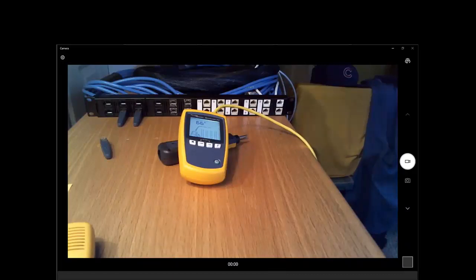Okay, so if we are trying to tone on a link that is active, different switch ports are going to treat that signal in different ways. And sometimes they will feel attacked if they're being toned, and they may shut off that port. There's a safety mechanism in the switch that says, don't send me a signal. So they'll block that out. So it can be really tricky to tone into a switch.